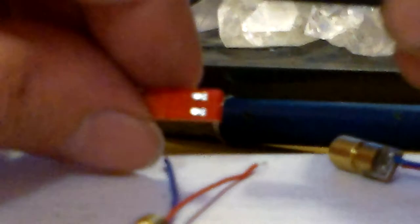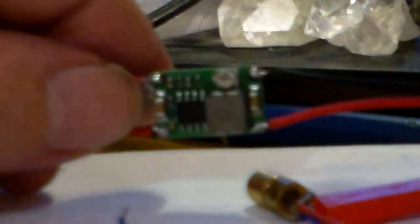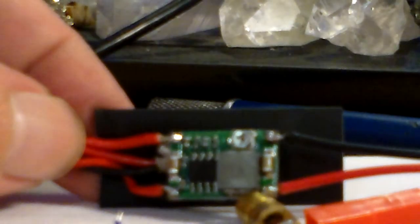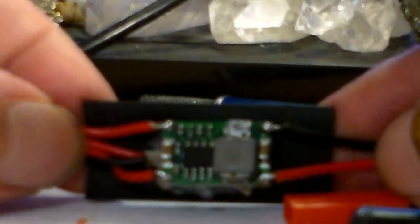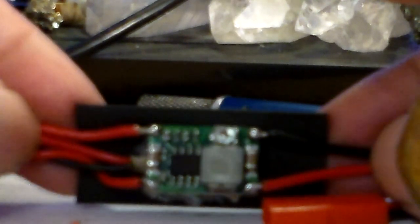Okay, so we're gonna take it and put it on the male JST connector. We're gonna feed it through, make sure that your thing on the back is able to slip through. Oh damn, I forgot one special one. The reason why we had the marker. Okay, what we're going to do is take our JST connector, put it on the back. Okay, we're going to put our shrink tubing right behind our buck converter, and we're going to try to get it right in the middle behind the buck converter, and then we're going to take